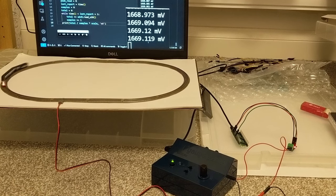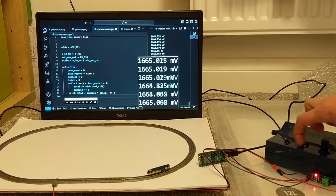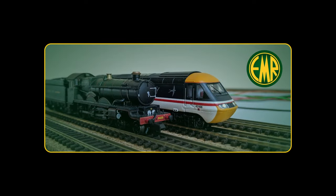I'm not going to need super reliable block occupancy detection for what I want. I just want signals to change after a train has passed them, so I'm leaning towards just using the infrared sensors. That would also avoid the need to electrically isolate sections of rail. Whether or not I'll actually be able to make colour aspect signals that aren't massively over-scale remains to be seen. That's all for now — bye-bye, see you next time.